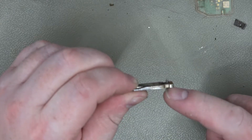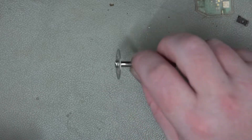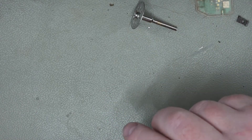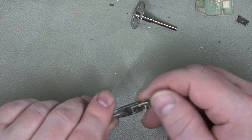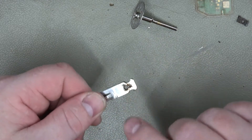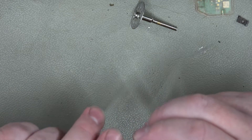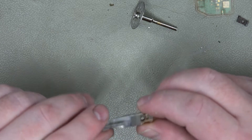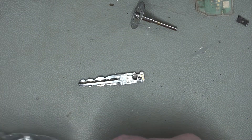So I think what we do is use the Dremel to cut the two ends of the thread off, and then I'll drill that hole out. I'll be back when that's done. Alright, so I went ahead and used this to cut one of the ends of the threads off, but luckily that heated it enough. I started trying to drill but it was going very off-centre, so it heated out just enough that I could loosen that thread — which is good because I didn't want to damage the threads in here. So that saves me re-tapping it.